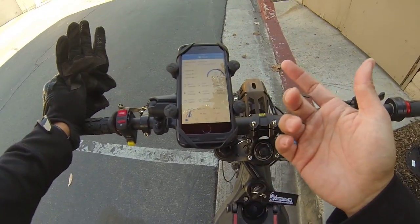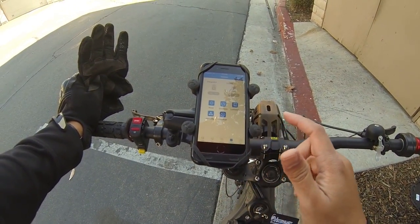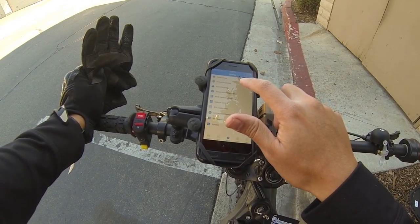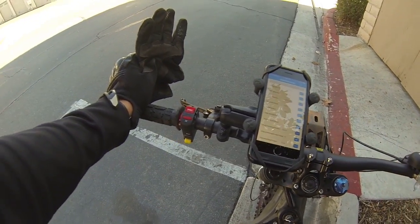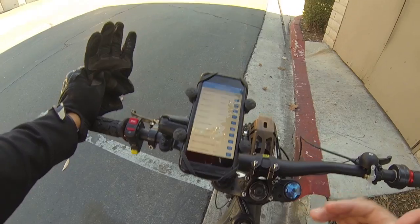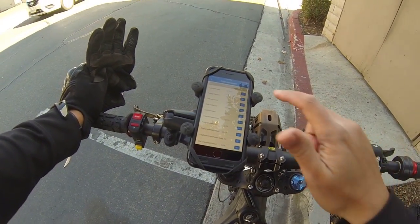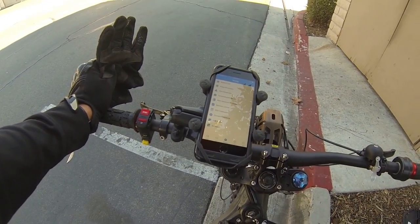And then you can actually adjust some of the settings. It is actually pretty conservative. It's going to kill the charger at exactly 4.2, which means it's not going to charge it to exactly 100%, because most cells will go to about 4.25, because when you're charging, it's going to be a little bit above. But this is going to help protect the battery and increase its longevity.